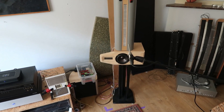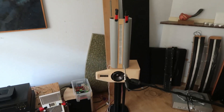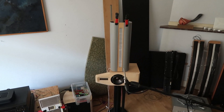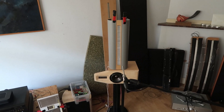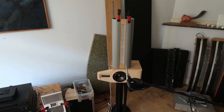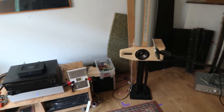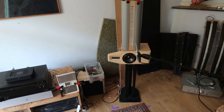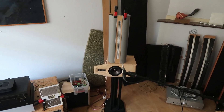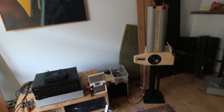I know these drivers are 86.6 dB and I measured them without any crossover. Their most efficient part of the whole woofer was around 86, and these did the same when I measured them - minus 6 dB, compensating for the impedance that is 1 ohm, so it will act like it is a 4 ohm driver at the same efficiency.